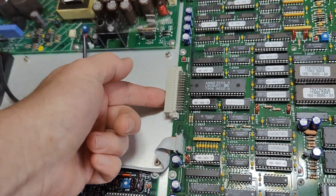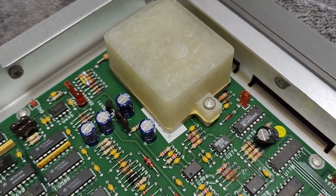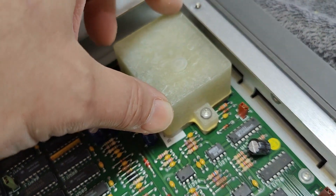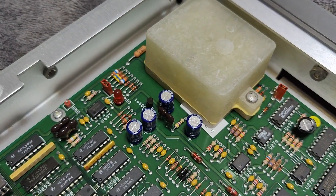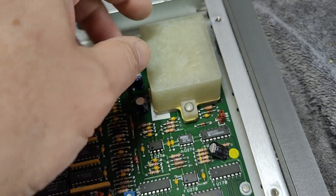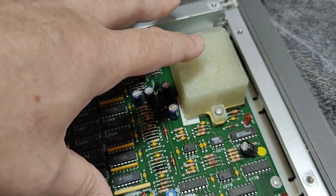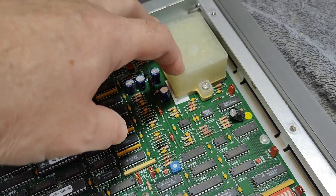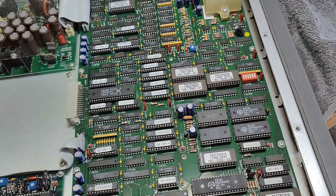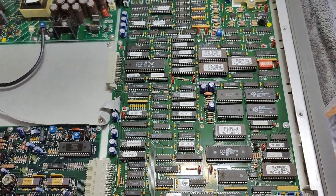I'm a little bit worried about the two screws here - they're a little bit loose. In this area we find the reference clock oscillator. I believe this is isolated from the environment - there's maybe a little heater in there. This top screw is for adjustment, and there was a sticker on top hiding this screw. This clock is used for reference and stability for the whole TV station video signals, so they are super nice and stable - and this is of course also what this unit is doing.